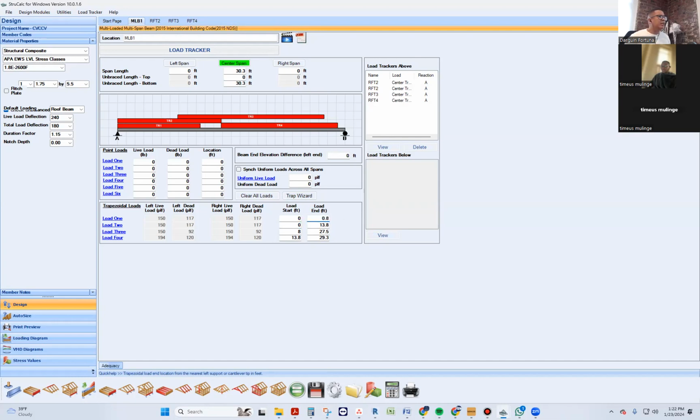It looks so weird, but I'm not going to question what the diagram looks like. It doesn't matter to me. Also, the starting point of the second one needs to change, remember? You know what? Forget about it. It doesn't matter, because we're just adding 3 more feet of load, so that we know it has 3 feet of extra tributary width, of area. But if you're adding it from the first one, then your second one is indicating the starting point. It's no longer 8, it's 11. You get what I mean?